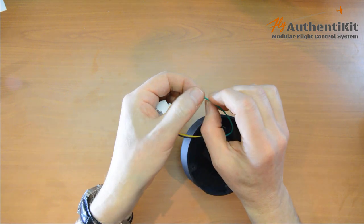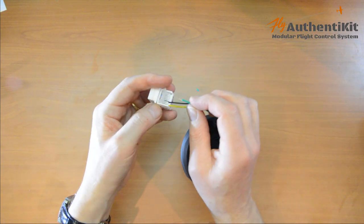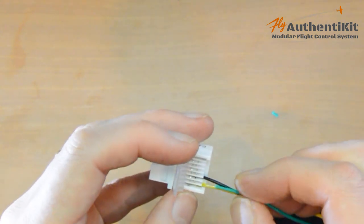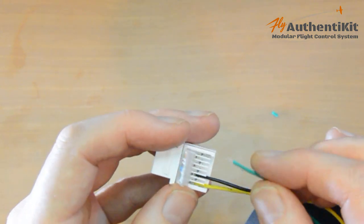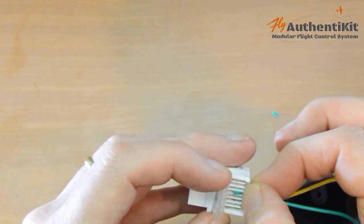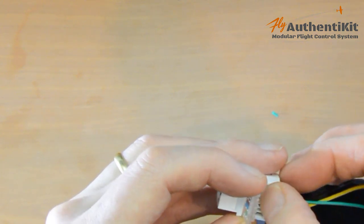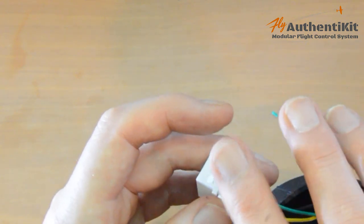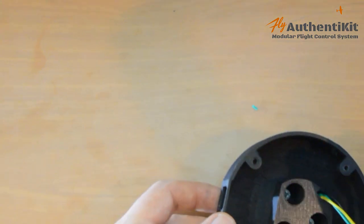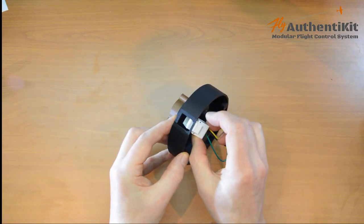So just to be clear on this, I'm peeling off the insulation. There is an argument you don't need to do this because the teeth of this device should cut through, but a lot of the problems I had with the spade grip were when the teeth didn't quite cut through. So I am peeling off the insulation, and I'm pressing the insulated wire into the channel so that the revealed wire is just over the teeth, and then clip. Nice sound connection. Now we pop this RJ45 through the side here.